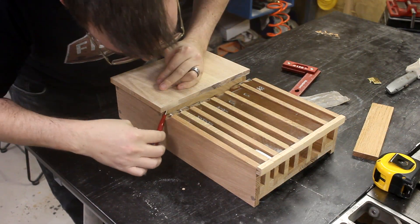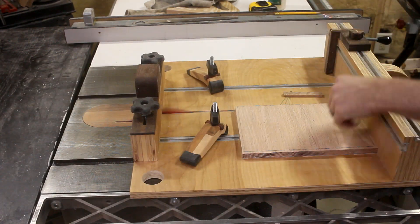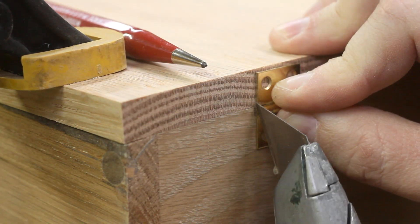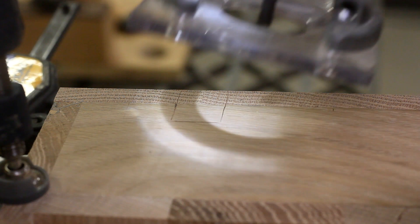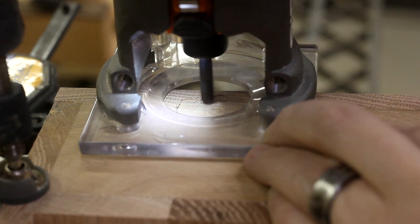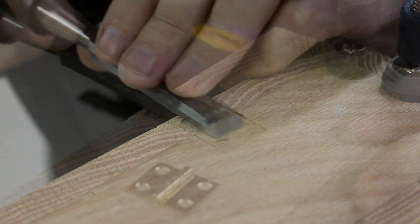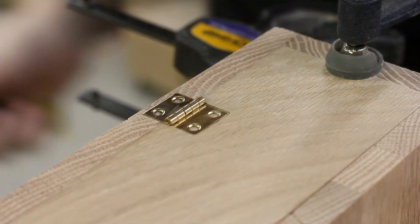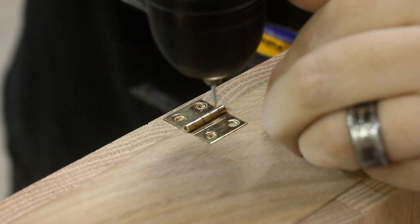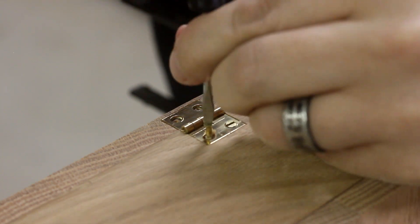The final piece to go on is the cabinet face. I put it in place and then trace around it to mark the areas that need to be trimmed off. Then over at the table saw, I can cut off those edges and get it sized properly. I decided to use brass hinges since I'm fancy like that. So I marked out where they need to go and then used my trim router to notch out the areas so I can inset them. A little bit of chisel work and I had the hinges sitting flush with the surface. And since I didn't have a drill bit tiny enough for these microscopic screws, I used a small brad nail instead. Then with the holes drilled and a little bit of earwax, the screws went in just fine.